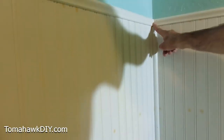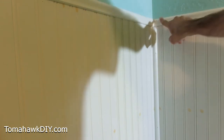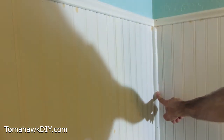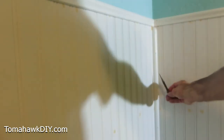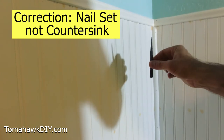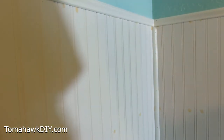To get ready to fill in nail holes, I'm going to check over each of the nails with my finger. They should be recessed and set back in. When I find one like right here, or right there is another one that's sticking out just a little bit, we'll need to sink those in. We're going to use this countersink — that's a pretty straightforward little tool. You could even use a nail to do it, though that's a little bit more challenging. We'll just tap them in.